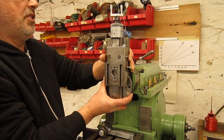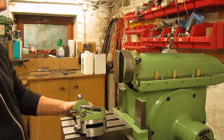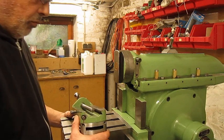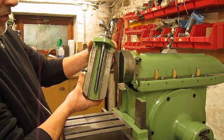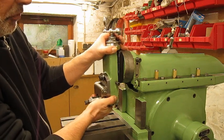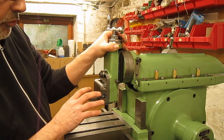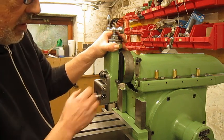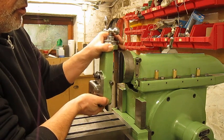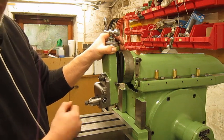I don't know if it's the official name — I don't think so. This is a very rigid system, but you lose rigidity in the tool holder. Can we pay some attention here? Especially for you, I take my machines apart. In this system, if the tool slide is completely down, we could lose rigidity. But in the primary system, we can put the cutting tool directly in the clapper — no problem. It's a very rigid system. But if the tool slide is completely down, there could be movement. So I don't know which system is the best — I think there are pros and cons for both of them.